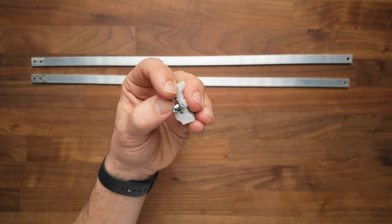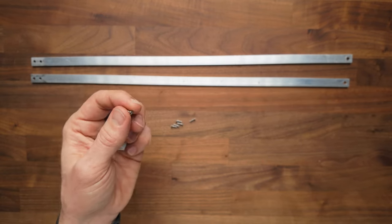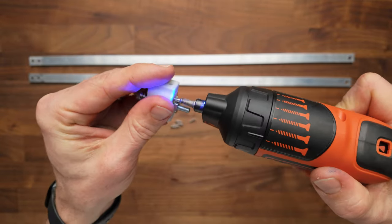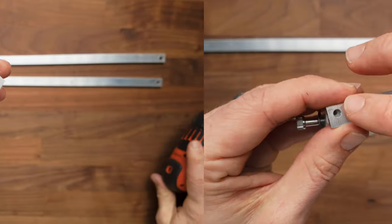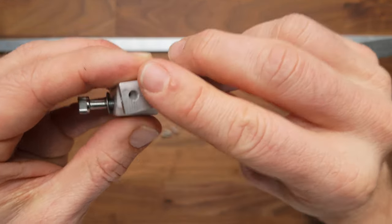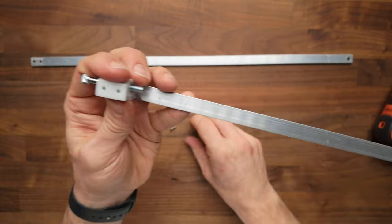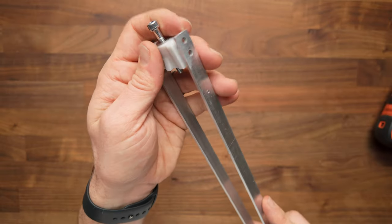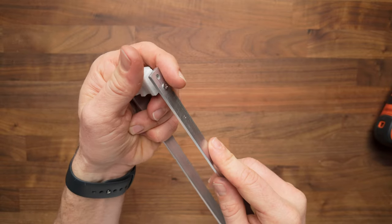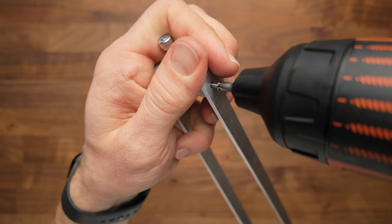After that, you're gonna take two of these screws and thread them in through these holes, and these lock this in place. This is a number one screwdriver you'd wanna use, but for the rest of the video, whenever possible, I'm going to use the fast way. Next, we're gonna take the two bars themselves, and we're gonna drive two screws on either side. Note that your bolt should face out the end, not into the center of the bars. It's worth noting here that if you have any marks on your bars, sometimes there are little bits of marks from our production process. The smoothest side of the bars should be facing inwards because the bearings will be riding on that inside edge.